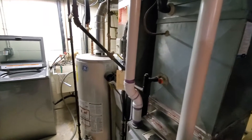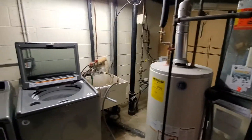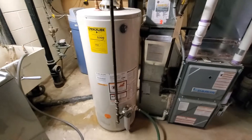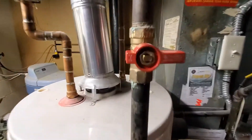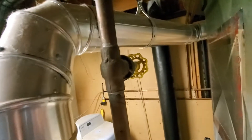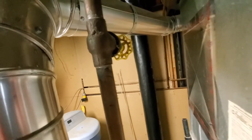Troy Champion Plumbing out of Eagan, Minnesota — we are in Burnsville putting in another water heater. Going through our checks again: we have a good approved gas valve. This water valve we are going to replace — it's a gate valve, it's not a full port valve, and it still has lead in it.